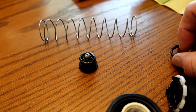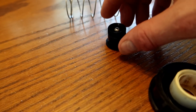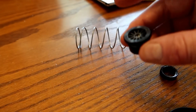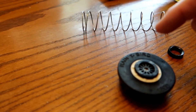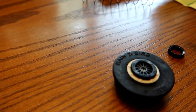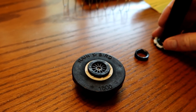After closer examination, it appears that this thing is broken. I believe this piece is supposed to be connected to this piece as one piece. I think what happens is when the head retracts back into the housing, if it pulls too hard, it can sometimes snap the head off — and I think that's what happened. So we know it's a Rainbird head, 1800 model. I'm just going to bring this stuff over to Home Depot and find a replacement for this.